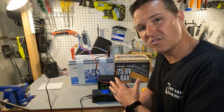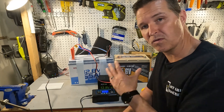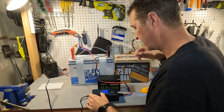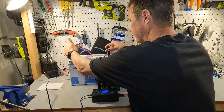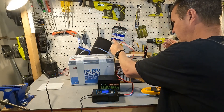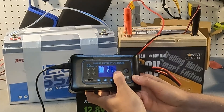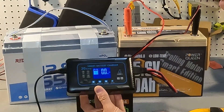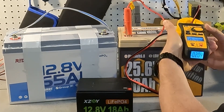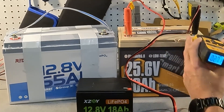What's nice is that this charger automatically switches from 12 to 24 volts — there's nothing you need to change. Moving directly from the 12 volt to the 24 volt battery on the lowest setting, the charger automatically switches to 24 volt mode. It shows the battery at 26.7 volts and charging at 2.9 amps on the display. The clamp meter confirms 3.01 amps — exactly what it indicates.